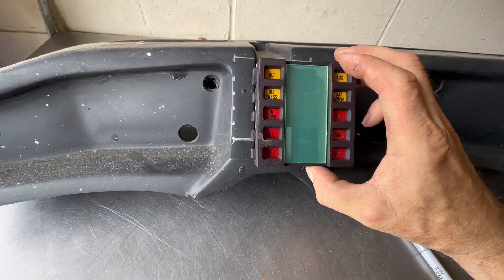I placed the voice box there, traced it, traced those teeth right there, and on the bottom did the same thing — so it's right about over here. That's basically where the voice box is going to go. I'm going to end up drilling it out and then very carefully using a Dremel and a file, very slowly opening up the opening.